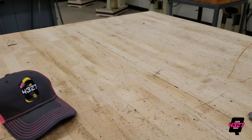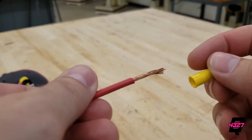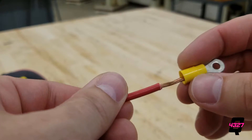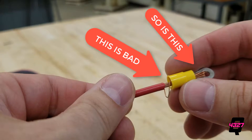As a tip, you know your wire is stripped enough if you can make a metal-to-metal connection and no wire is exposed on the other side. Exposed wire runs the risk of shorting out your bot with loose electricity, and that's never a good thing.